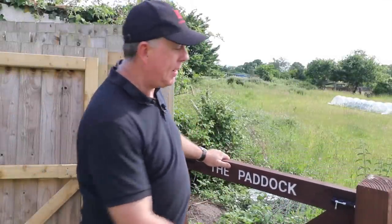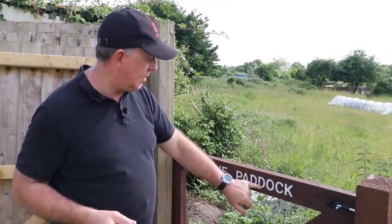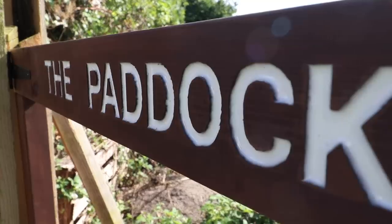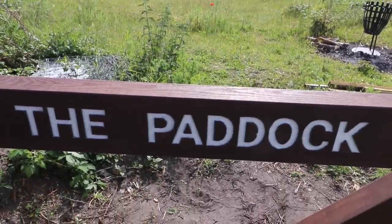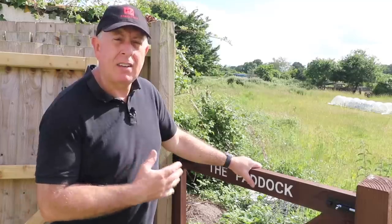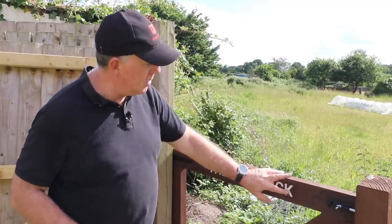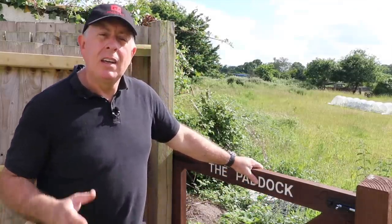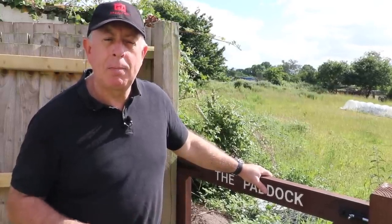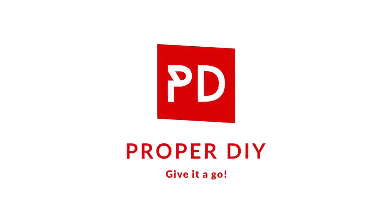There you go — fully complete, in place, and working. I must say I'm really glad that I left this resin one to two millimetres low because there's no evidence of any bleed into the timber on the surface. And also if I'd brought it up to surface level I'd have then had to sand it down, and without a thickness planer or a drum sander I'm not really sure how I would have done that other than expelling an awful lot of effort myself. So that's definitely the DIY solution — just leave it a little bit low and you don't have to touch it at all. I hope you've enjoyed this video — if you have, please check out the other ones on the channel, subscribe, and go and have a look at our Patreon page where you can support us and see extra weekly videos. Until next week, I'll see you then.